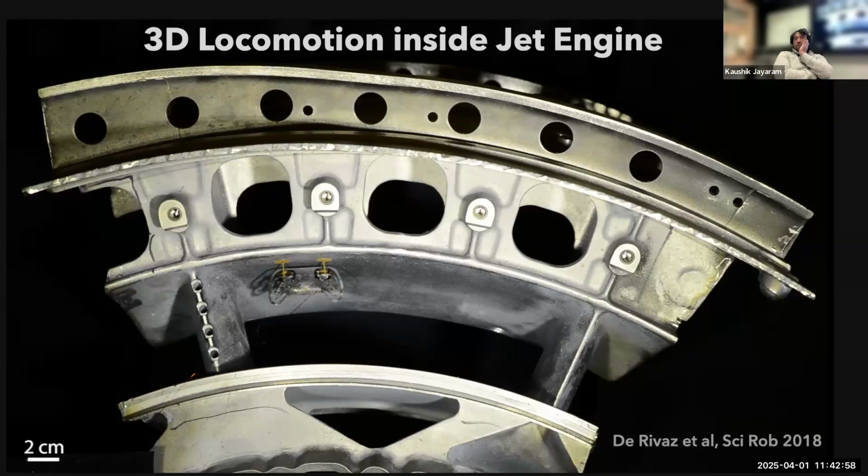The advantage is that they work really well on inclined surfaces because they're passive structures. But one of the challenges, because they're passive, is that it's hard to disengage from surfaces, and at times they require preload to get good traction. So you need to push into the surface. These are shear-based adhesives. The more you slip, the better you stick onto a surface, because of the grooves and the patterns. So you need to press into a surface a fair bit, and on the floor or slightly inclined, it's a lot easier.